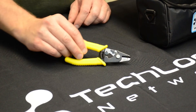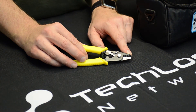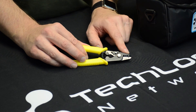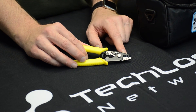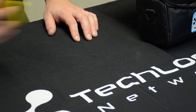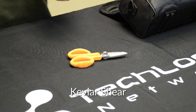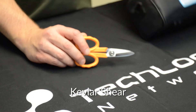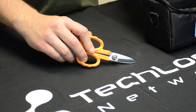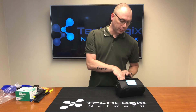You'll have your fiber optic three-hole stripper. You've got the 2 millimeter or 3 millimeter strip hole here, then 900 micron and the 250 micron — that gets you down to 125 micron, the bare fiber that you'll need. Also included is a Kevlar shear for cutting the aramid fibers or Kevlar on the fiber optic cable. Be careful, those are sharp.